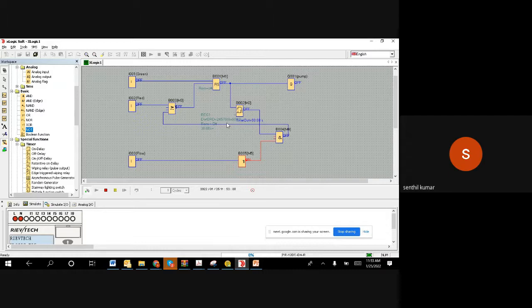So when you switch it off, it has to go off, but not immediately. Ten seconds later, because within those 10 seconds you would have reached the bottom, and then it can go off. So basically, what we have done is you switch it off on top. You already switched it off on the top before you step down, but the light doesn't go off immediately.